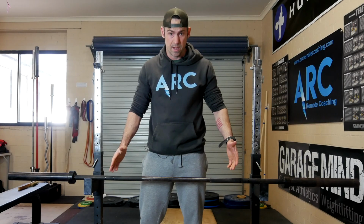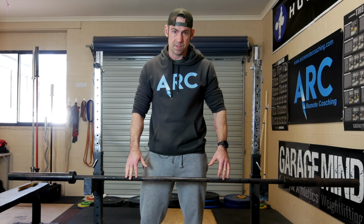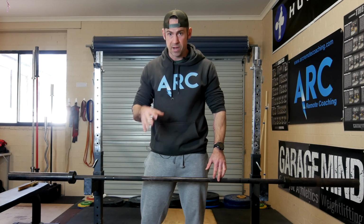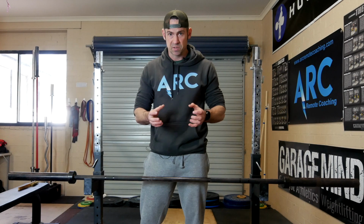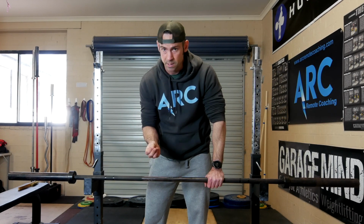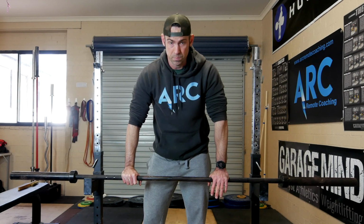All right, so here's our bar. Now you might think, shit, that looks rustier. So what's happened is the acid has interacted with the rust and it's breaking that rust down. And that rust isn't going to magically vanish into thin air. So as it breaks down, chunks of rust, residue of that rust is still going to remain. But you can see it just wipes off. So what we're going to do now is go at the bar with some oil and our brush.